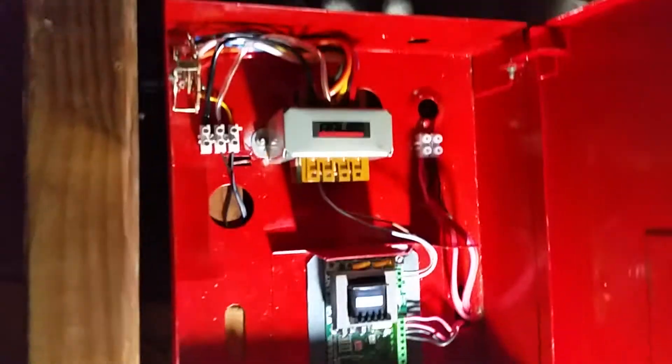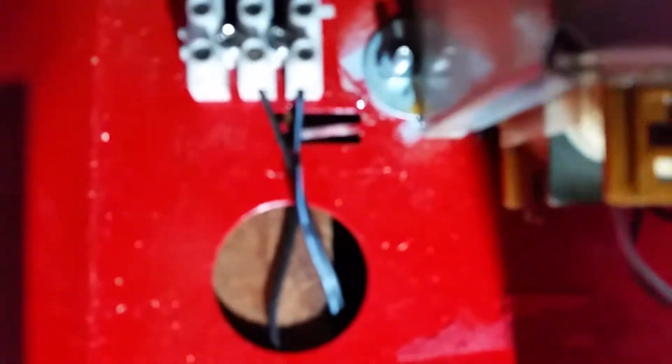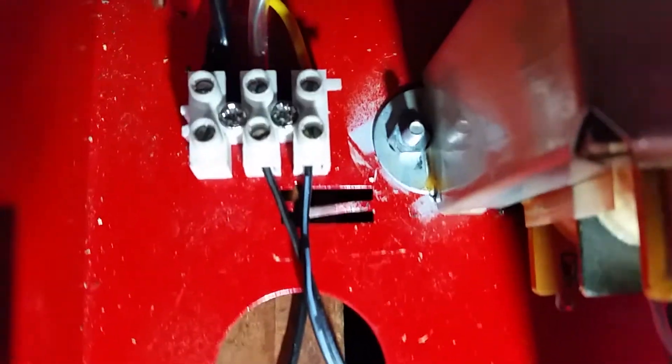Probably can't see the cable very well. And then I've got a 100 volt transformer here that steps it down. There's a variable volume adjustment on the side there, and that goes out to a horn speaker on the roof. It's running at about 20 watts now, so it's pretty much maxed this out — so it's pretty loud.